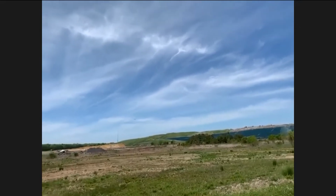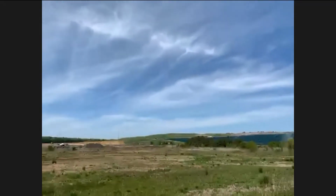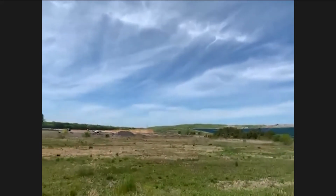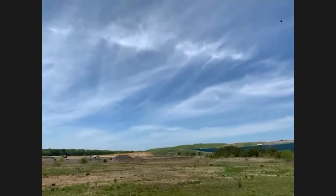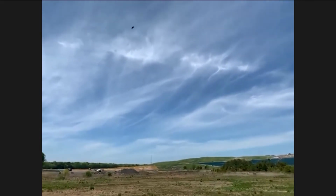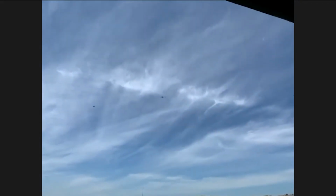And now it's going to turn around and return to launch. Oh, okay, it's going to climb up. So as part of the RTL safety checks, as the way we have it configured, it'll climb to 150 feet and then head back to the launch site and land on its own. So now it's returning to launch. It's holding at the position for a little bit. There you go. Now it's coming down.